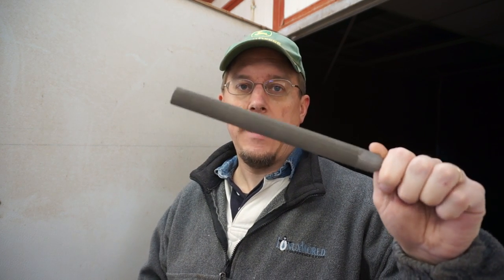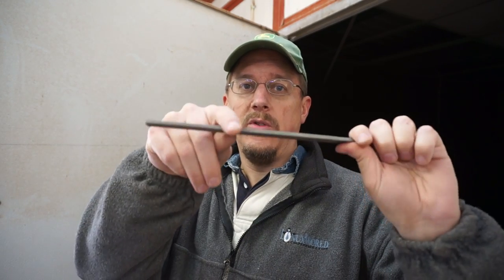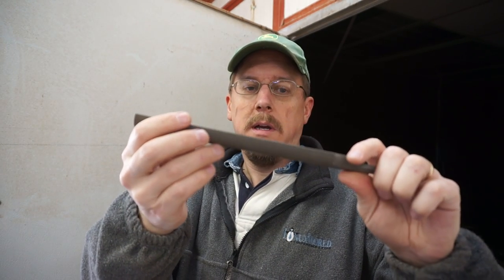Now that the bulk of the rust is removed, it's time to sharpen the shovel. Sharpening is something you actually want to do — they typically don't do it when you buy it, but it's one of the first things you should do after you get it. It makes a huge difference in how easy it is to use. The first way to sharpen is using a file — specifically a bastard file. It has a rounded edge we won't use and a flat edge we do care about. Most types of files would work at this level — for garden tools they work just fine.